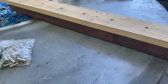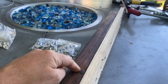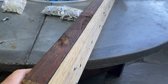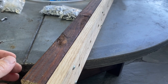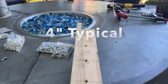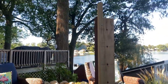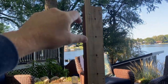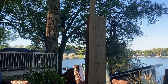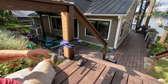The next thing I did was make a jig out of a piece of two-by-four. I had a scrap piece of oak so the holes wouldn't get bored out. I did my spacing for my rail and cut a notch out that is designed to slip right onto the rail — you can see the notch fits where the two-by-four of the rail is. Then all I have to do is go through and drill right through there. It's all pre-spaced. I would recommend doing a jig like this — it takes a little time to set up, but once you have it, you know where all your holes are going.